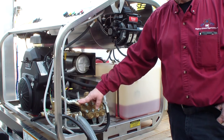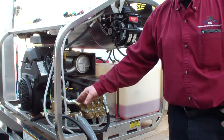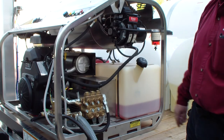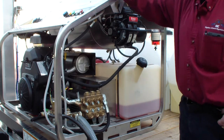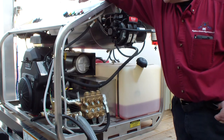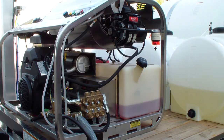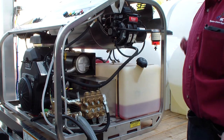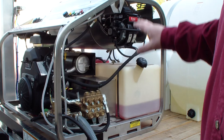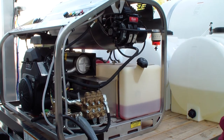There's a pressure release here — if the pump accidentally gets overpressurized, it will pop off and let water leak out, which indicates you need to check it and have someone service it. You also have a pressure gauge to help indicate your pressure. There's a high-pressure chemical injector on this unit with an injector hose. Normally if you want to bypass back to tank, you don't need the high-pressure injector since soap can get back to your tank. With our high-volume downstream injector, you typically don't need it.